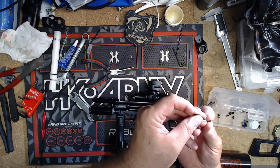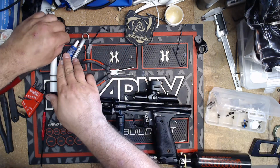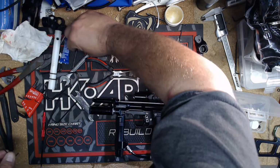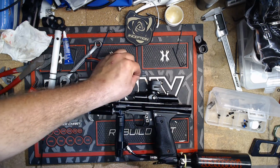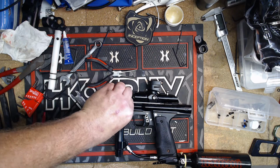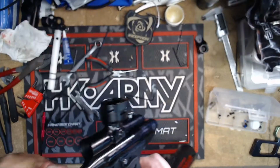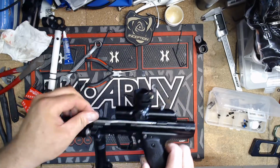Hey, what about that other little set screw? So let me put that one in. That's just the set screw for the RAM. As I lose it. Now I got a little bit of Loctite right here that's still, there we go. Purple Loctite, Permatex Purple Low Strength. Make sure that's all on there. Snug it where it's just snug.